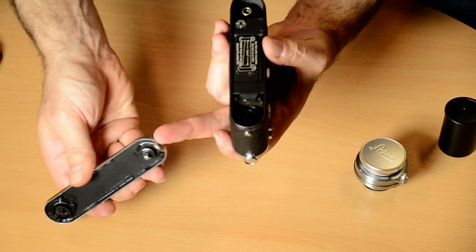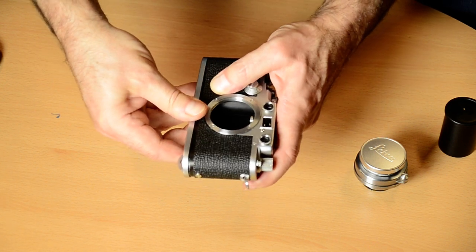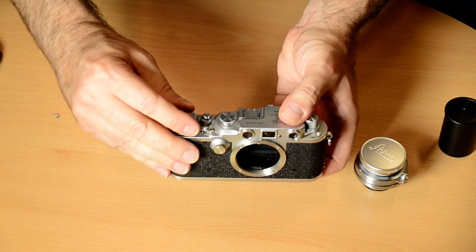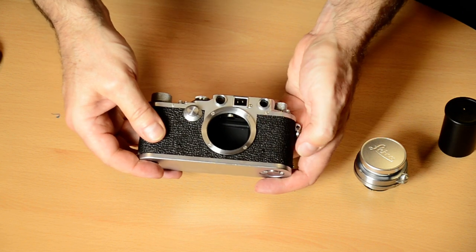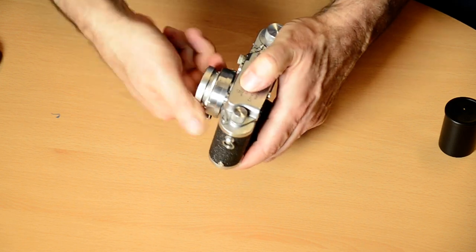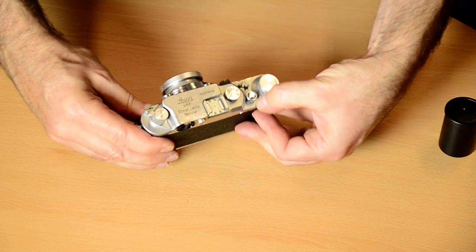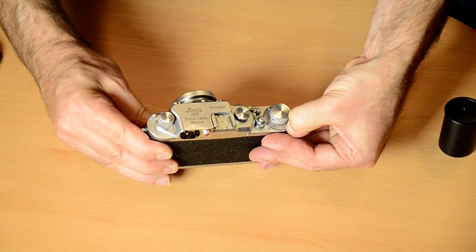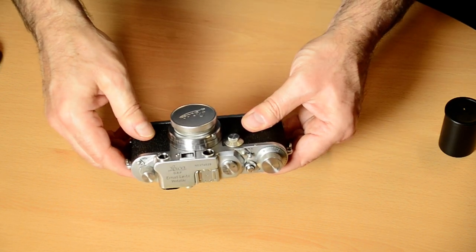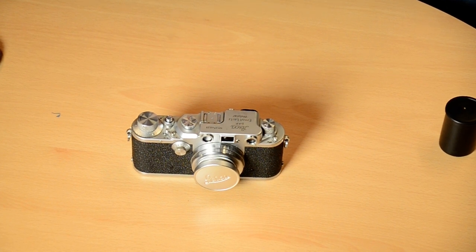We're good to close the lid up. The base plate will align this point to this point, and this will go into there — that holds the base plate on. We lock that in. We can wind that on now because our shutter curtain protects everything. All that's left to do is attach our lens — this is a 50mm f2 — and set the film counter. The film counter you have to set manually. I always set it one before zero, then the next time I wind on I will be at zero. So I hope this has been helpful, and I hope you tune in for more tutorials on how to use these screw mount cameras. Thank you very much.